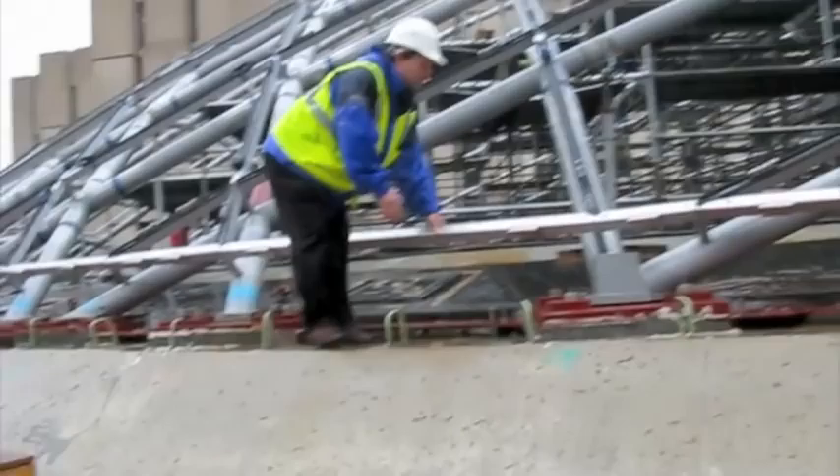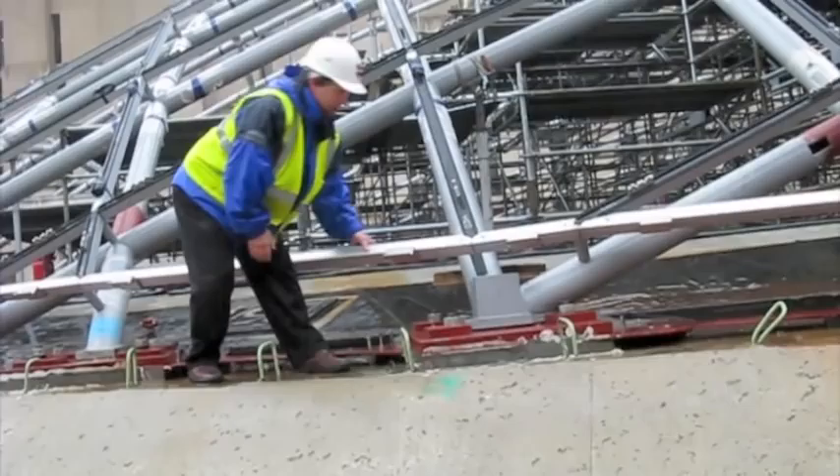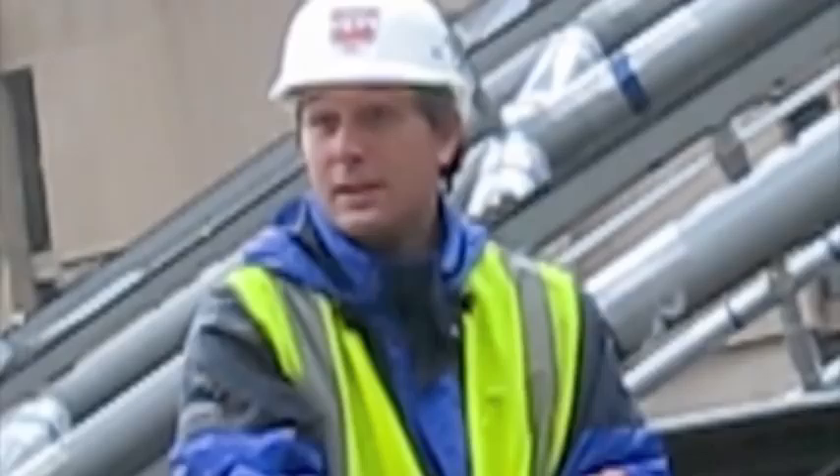This material is what's actually going to sit on top of this steel substructure. These nodes right here are the aluminum framing that will actually support the glass inside these gaskets. So one section of glass goes here and another section there — they'll be put together and then filled with sealant, so it will be a continuously smooth, weather-tight surface.